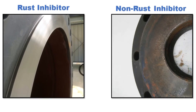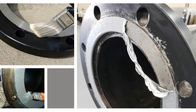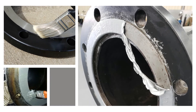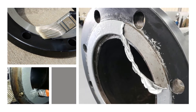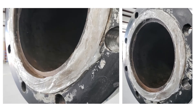All right guys, so typically flange face coatings fall into two categories: those that have rust inhibitors in them and those that do not. Coatings that have rust inhibitors in them are more widely used due to their added benefit. For example, paint-like coatings on the market are applied with a brush and once cured can be easily peeled off the flange face. Coatings without inhibitors in them, such as grease, just create a barrier that keeps moisture away from the flange face.